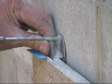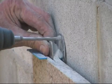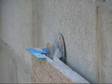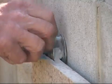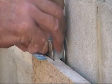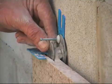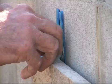on the website. The 15 millimeter set size clip is the most popular as it allows you to mechanically fix 20 millimeter thick panels and to install them that way, or to also install them with a glue on the back, which if the cut is in the middle of the bed, this allows you 5 millimeters cavity behind the panel.